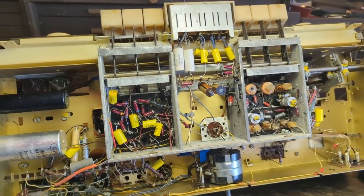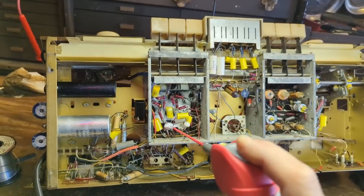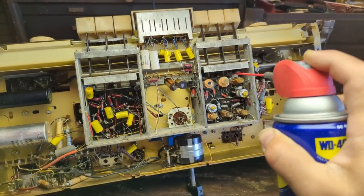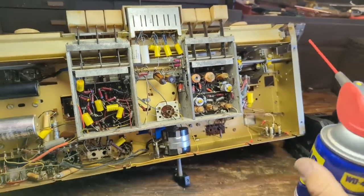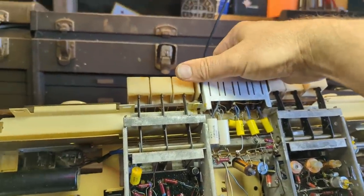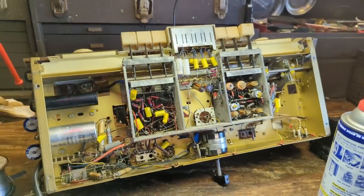We got all the capacitors replaced - that was as fun as usual. But what I need to do before anything else is probably clean all of the contacts, probably get to it from underneath here. I'm not afraid to use a lot either because these switches are very gummy. Especially get these guys up here. I know these radio buttons are certainly not working very well at all so I'm going to make sure and get them real good. It looks like we have some controls under here that need to be cleaned up. I need to get the volume controls as well, and then we're going to put this back into the cabinet and see if it works better.